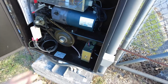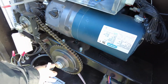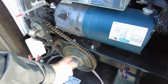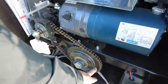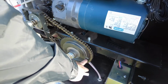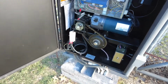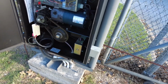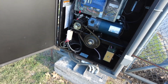I also use that when I'm adjusting the tension on these clutches, because what I'll do is I'll adjust it to where I think it's the proper tension, and then I run the machine and see if it ever moves, if it creeps away. So I run it like 10 to 12 times after a new install and see if these lines get out of alignment, and then I usually feel pretty good after that, because you don't want to over tighten it, right? You want to back it off to where it spins a little bit and then get it to where it stops spinning and give it about a quarter turn a little bit tighter.